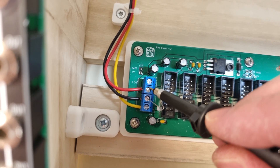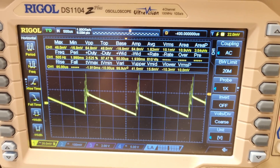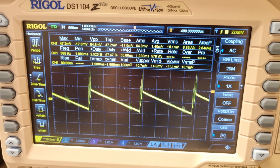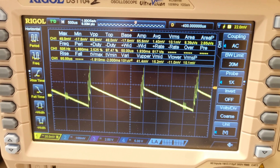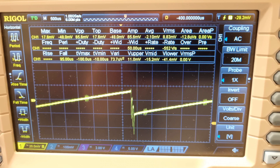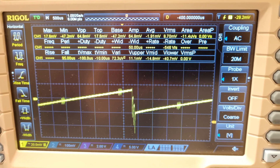So this is what the disturbance looks like. My choices are basically to replace the power supplies with an SMPS that is more suitable for audio, or build a linear power supply. But I decided to try a third option, and that is to make a filter board to see if I can improve the existing power supply.